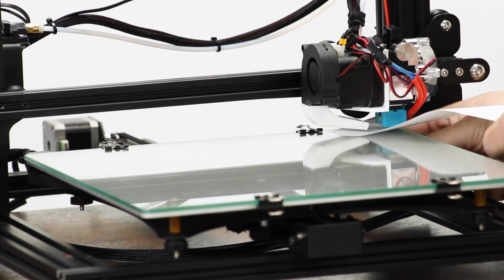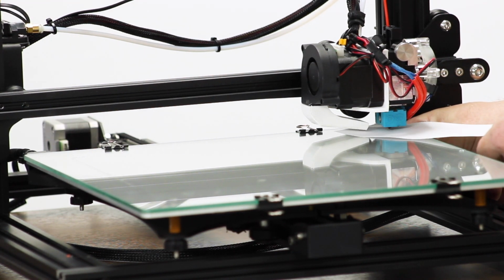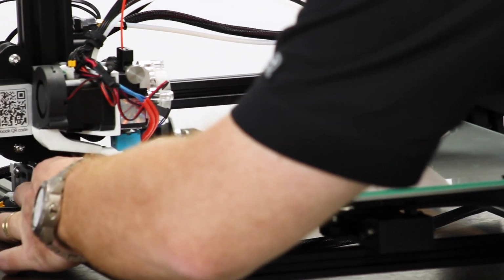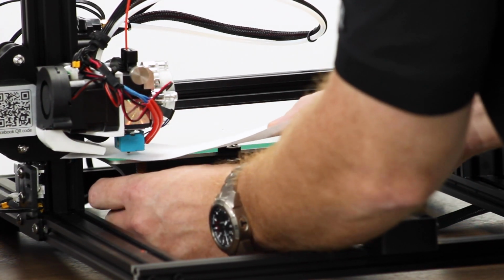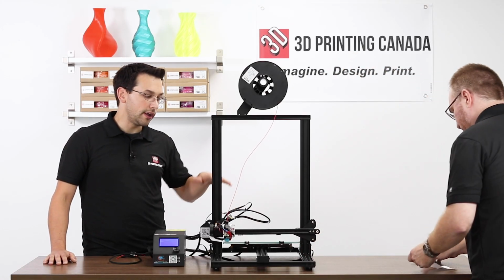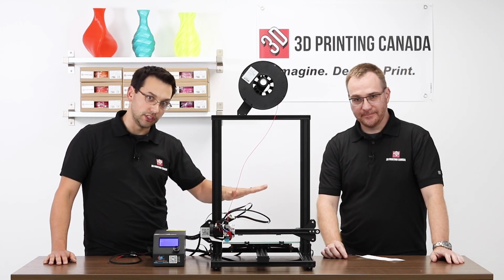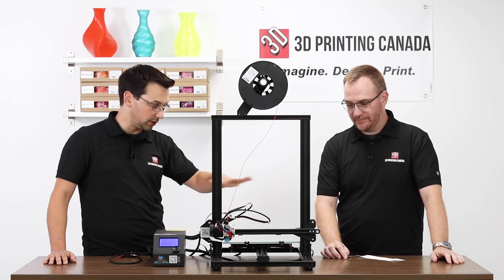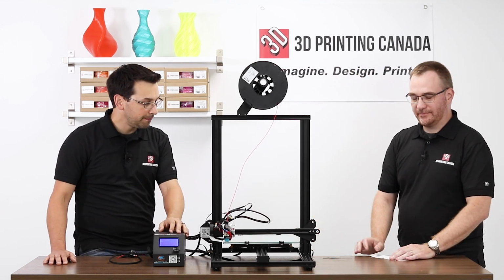Same thing. As you remember, that side was the low side, so there's not even any resistance until Dominic has unscrewed that screw quite a bit. Okay. So as you change each corner, you're influencing the other corners as well. By raising this side, you would inadvertently raise this one just a little bit because you've taken off some of that angle. So you're probably best to go around twice, once you've got everything figured out, and then a second time just to confirm that you're perfectly level.